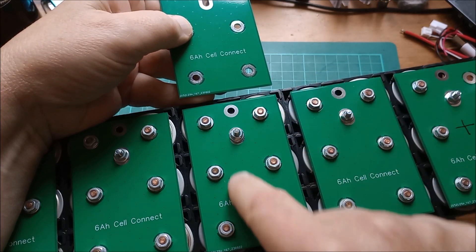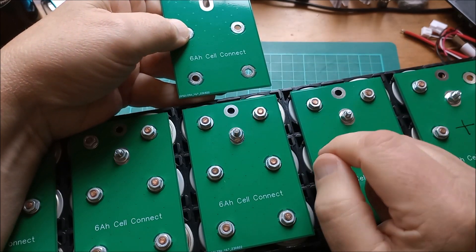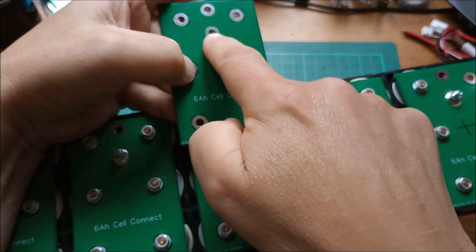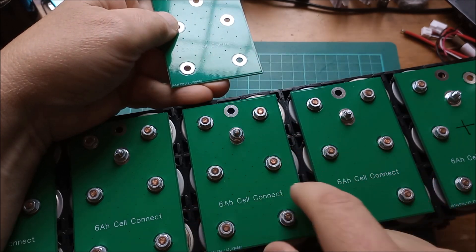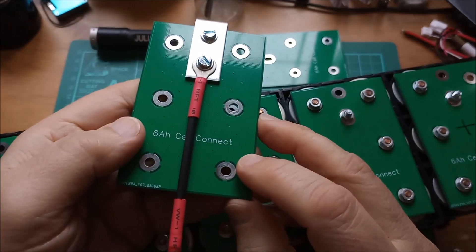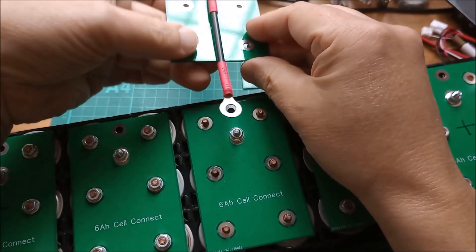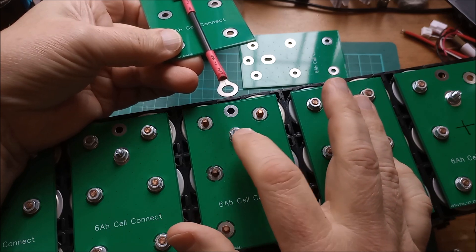What I really need to do is link the copper area — these two pads here — with the copper area up here. Now I was concerned: the one up here has an angle bracket in these two holes, so I can screw onto that. But this one has these two holes just arbitrarily on the plastic cell holders, and I was thinking I'm going to have to use a ring terminal on this bolted one on the top, but I'm going to have to solder the end of this wire to this slotted hole on the bottom board.